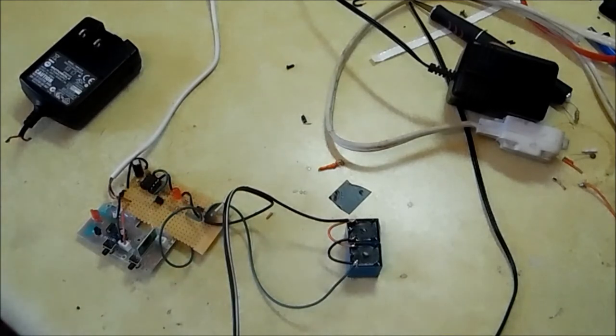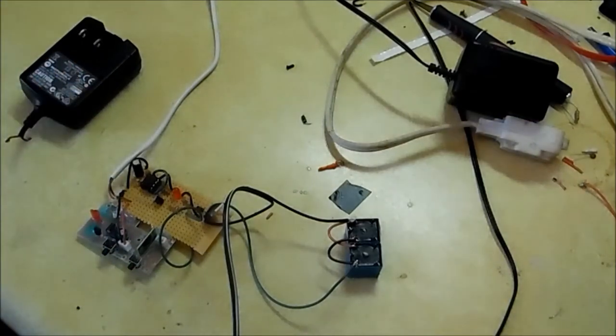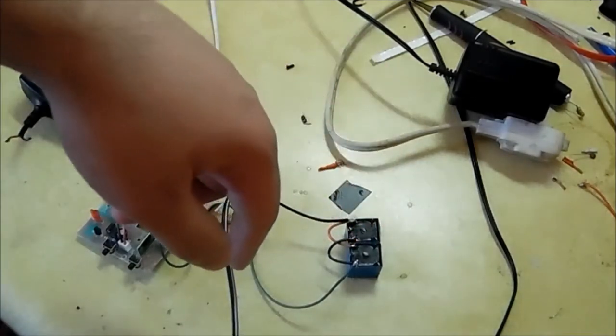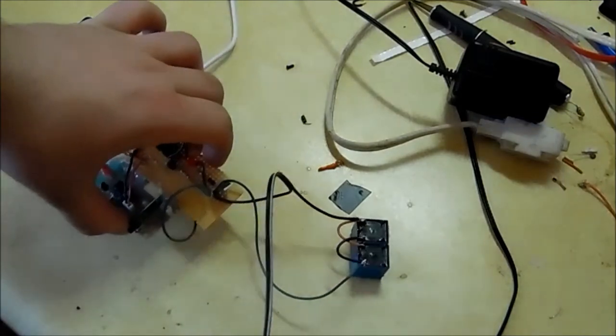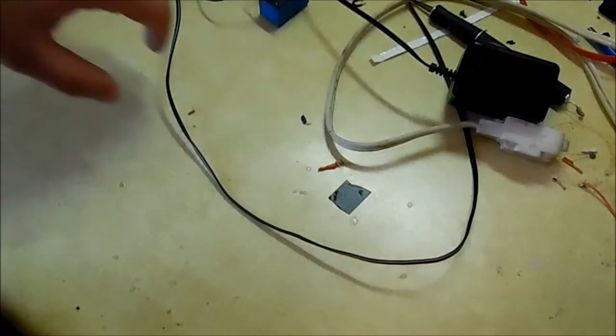It works. I've got my 5 volts going to a USB extender which goes to my hub on the wall, and the 9-volt power supply is right here for the relays. All that's left to do is add the wires to the relays that'll go in between the power or ground of the router and modem, and then I'll show you the circuit before adding those wires.